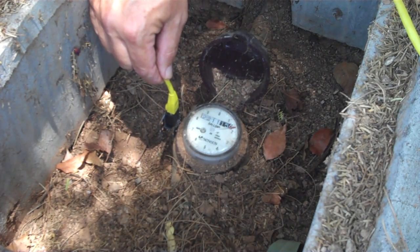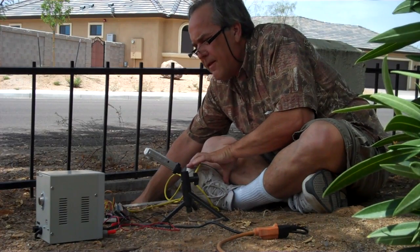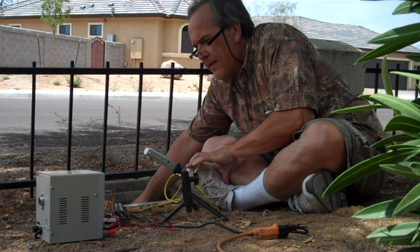If you look at the display, all the axes are showing change, but the x-axis has by far the largest span. It's going from roughly negative 8 to positive 130, which are kind of arbitrary measurements. You can convert it to micro-Tesla if you really wanted to, but it's irrelevant, because all I need to measure is rotations.